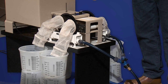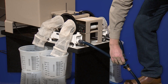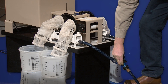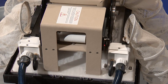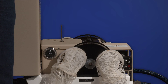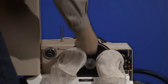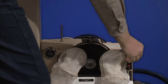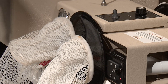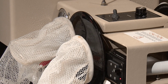Next we turn on the water. With the machine running, the water is adjusted from the valves at the wire. Start slowly until the water is circulating in the channels. Next we make the final adjustments to sensitivity and air control. Introduce a few eggs into the channel. Adjust sensitivity for proper picking — clockwise increases sensitivity. Adjust air flow for proper egg ejection — clockwise increases pressure.